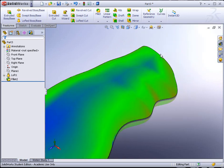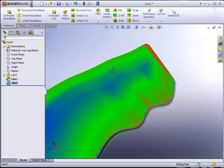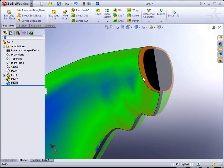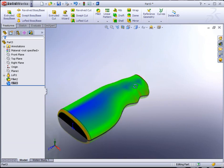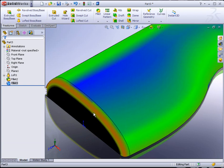Let's add an ordinary fillet on this side just to look at the effect again. Again you can see it's a harsh color transition versus the face blend fillet. They also have a name for that when you talk about curvature continuous: it's called G2 — the G2 surface condition. G1 would be a condition of tangency, and G0 would be just a harsh edge without the fillet.